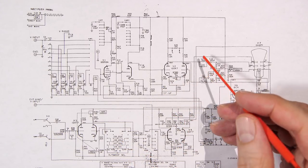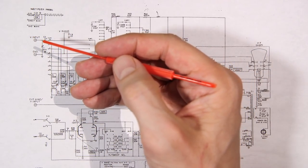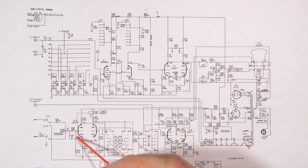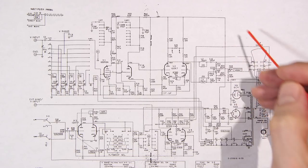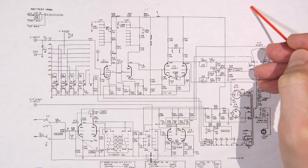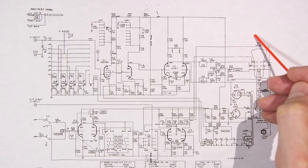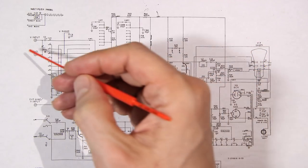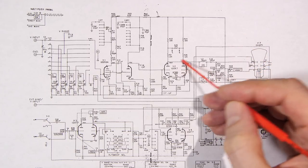So now, of course, as you're feeding something, say you're feeding, for example, a 60 cycle sine wave in here, not a very fast signal, you have to adjust the sweep speed on your oscilloscope so that when you're looking at the screen of the oscilloscope, it displays that correctly. So basically, you can look at it as a dot moving across the screen. So this is creating that dot going like this. The vertical deflection plates are going to take that dot because this is working now.